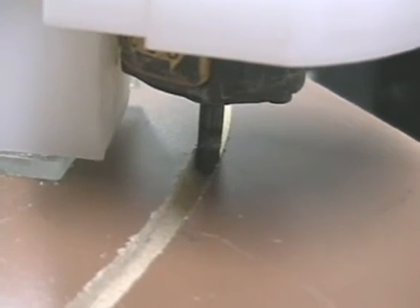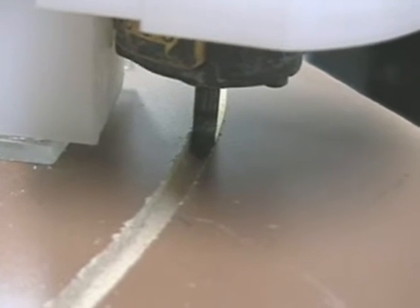I'm only routing a small amount — about a quarter of an inch — because I don't want to burn my router up. This is crucial: you don't want to overload the router or it's going to get hot and fry on you. So you have to do this in a series of cuts. This material is one inch thick, so the wheel will be one inch thick, and I'm going to go around at quarter inch increments until I've cut all the way through.